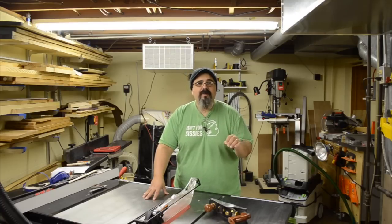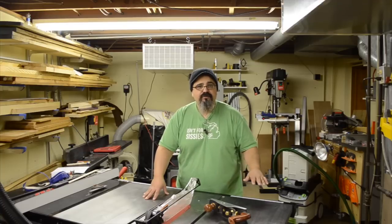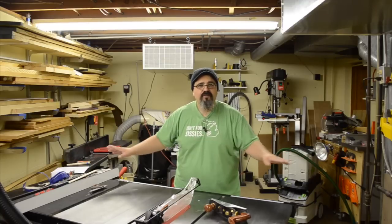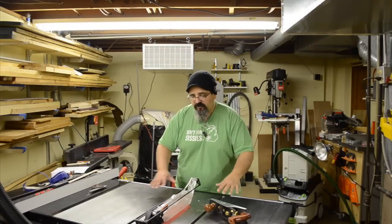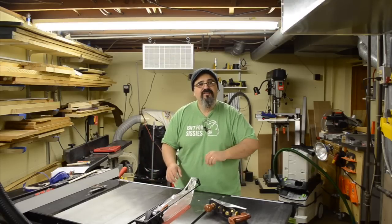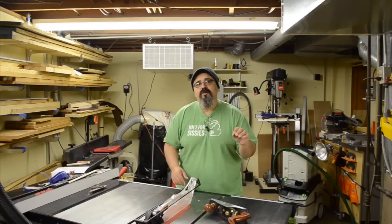While magnetic covers are expensive, the time and money they save you from constantly maintaining surfaces rather than actually working with them may be a far better investment. Many woodworkers do monthly maintenance year-round — a little rust removal followed by wax on the surfaces — and that works well. But when your tools are sitting idle, take a couple of minutes to cover them and brush off all the sawdust, because that layer of fine sawdust is actually what causes much of the rust.